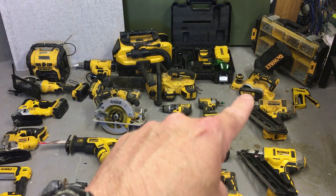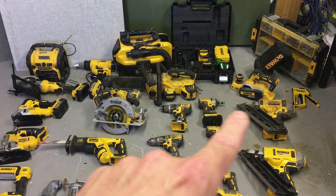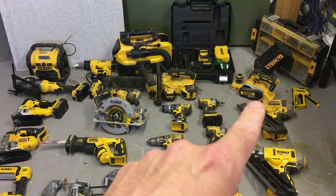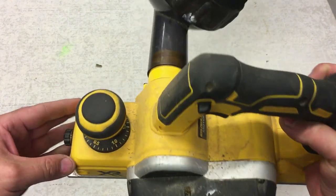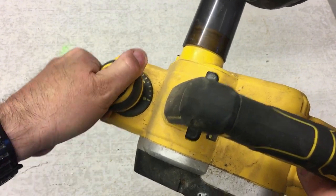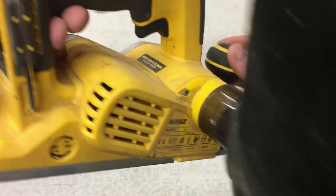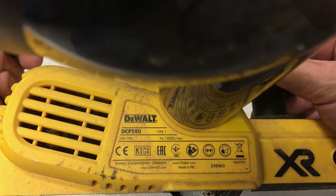Next is the plane, and it's another invaluable tool — I love it. I use it primarily for planing the bottom of doors, sides of doors, getting things to size, even gates and fencing. It's just a great tool. It's got a 2mm adjustment at the front — you twist the knob and it goes from 0.1 right up to 2mm depth. Excellent tool, highly recommend it.